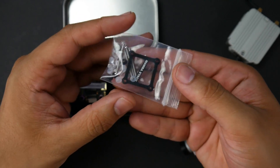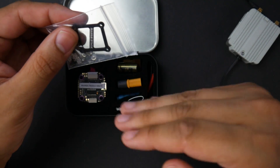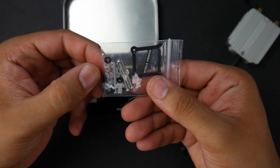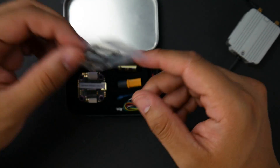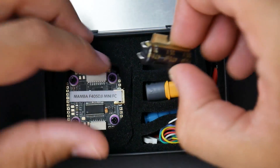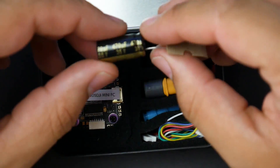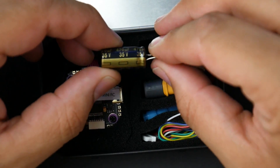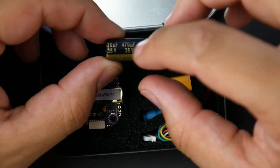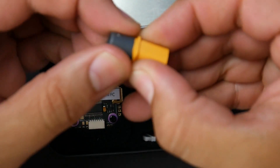Let's take a look at the accessories. First, there's a carbon fiber separator included, and they give you really long metal 2mm screws with 2mm rubber grommets, which is really nice to see — some are pre-installed. They also provide a low ESR capacitor, which is always great. These appear to be Panasonic, 470 microfarad at 35 volts, which will handle just about anything.